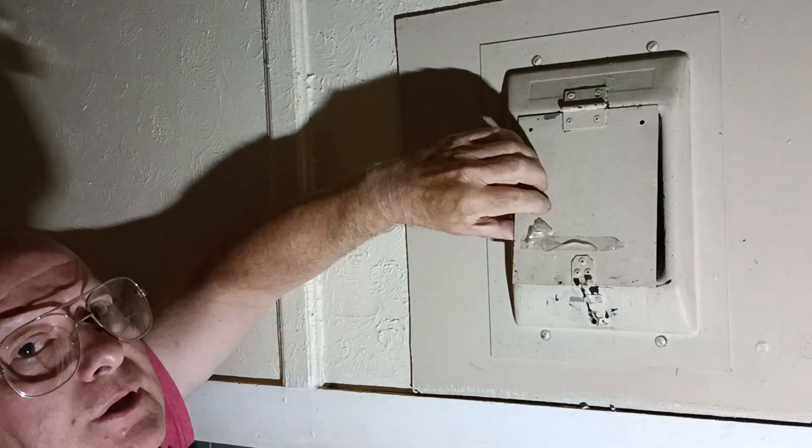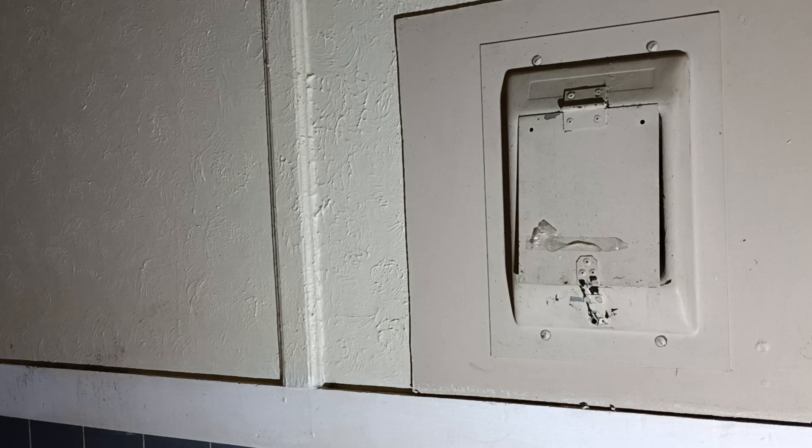All righty, that is how to replace a breaker in a Federal Pacific panel. This panel is obsolete, it's probably 30 years old, and we had a 30-amp breaker on some number 12 wire and a twisted and taped splice. So we put a wire nut on the twisted and taped splice and put the right size breaker in that matches the 12-gauge wire. Here in the country I was born in, we use 14 AWG on 15 amps, 12 AWG on 20 amps, and 10 AWG on 30 amps. That applies to both 120-volt circuits and 240-volt circuits. Thanks for watching, I'll see you next time.